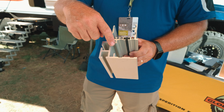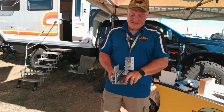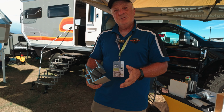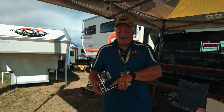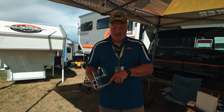It has a wire chase. You can see that it has these glue pockets. These glue pockets are specifically designed because we actually called Sikaflex. Sikaflex is what we use. And they said Sikaflex 552 is the strongest if it is this thickness. So we designed this specifically for that thickness.